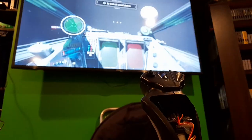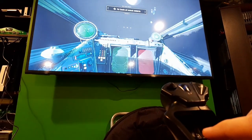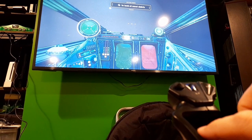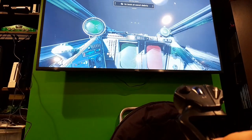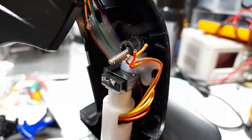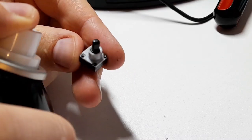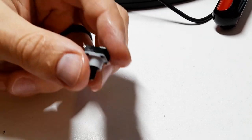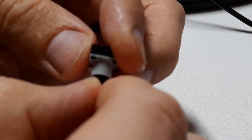I reset the spring and put it back together just to see what would happen when we plug it in, and we're no longer doing a death spin. Now I found if I put my finger on two wires I'd start turning left or right. This told me those wires were responsible for that death spin earlier, and it eventually gave me a shock — so, you know, that was stupid on my part. I'm guessing if I re-solder these wires to this potentiometer, when I twist it I'll be able to control the left and right tilt. I sprayed in some component cleaner and twisted it all around to clean up those contacts on the inside.